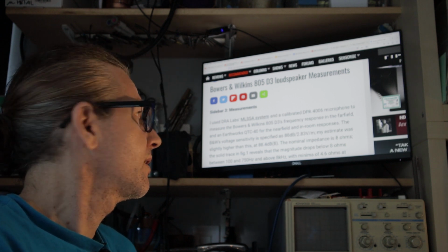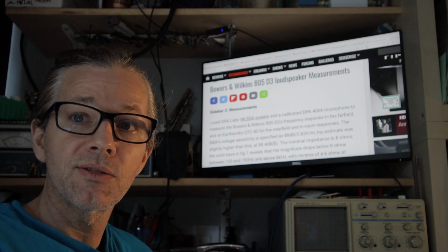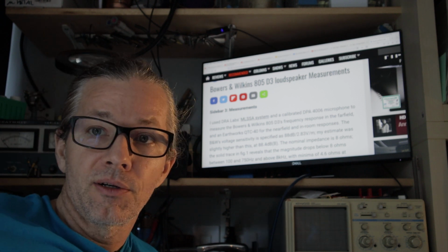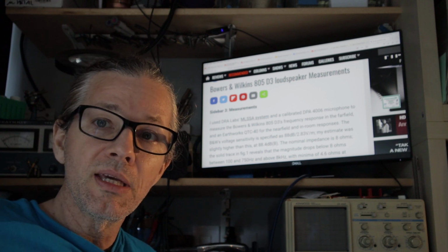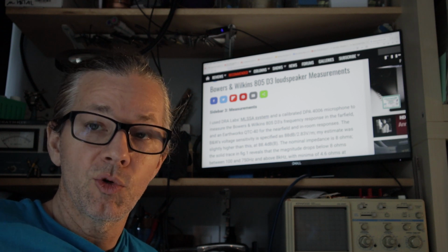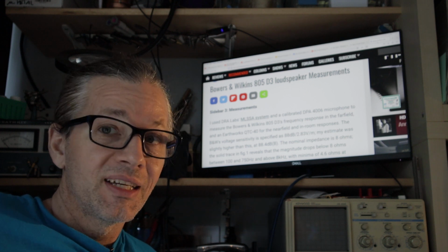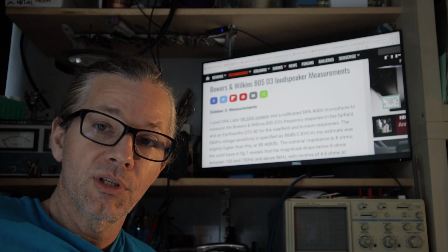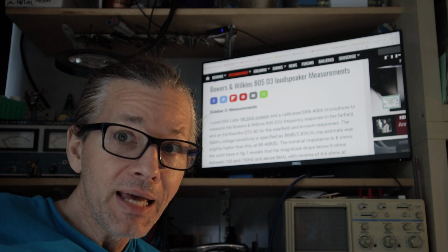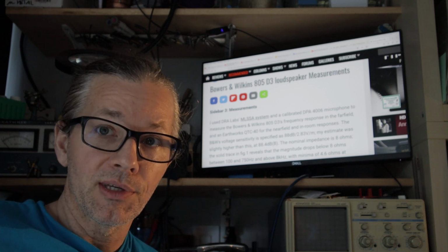So then you say, okay, these numbers tell me that this is a reasonably sensitive loudspeaker and 8 ohm nominal impedance, so this should be a piece of cake to drive. And if you have, let's say, a tube amplifier that is like a 20 watt push-pull tube amplifier, that should be a match in heaven for this loudspeaker and should drive it easily like a piece of cake, and you still have plenty of headroom even for your wildest listening parties.